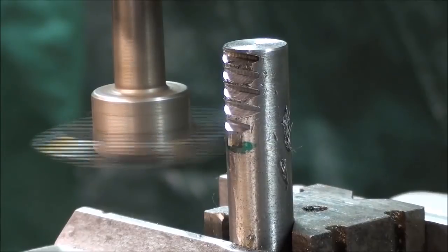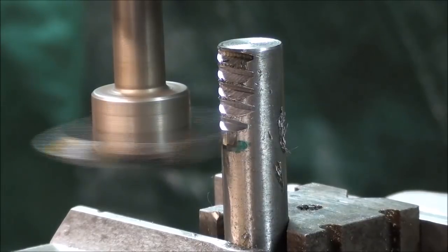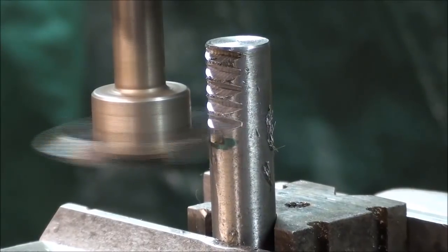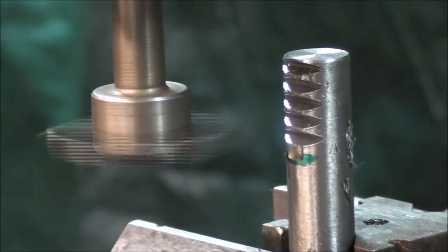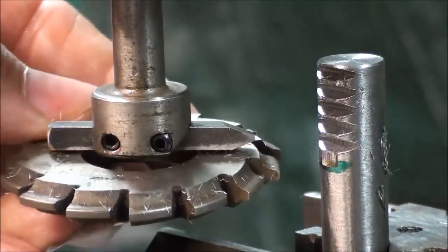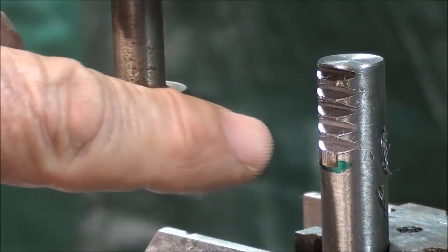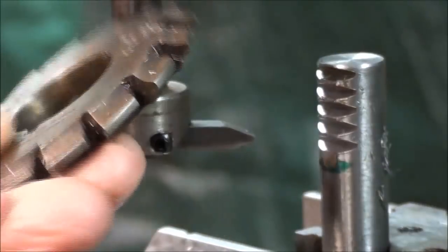This is Tooth 5. How far did I hang the cutter out of the fly cutter? Such that the cutter was approximately the diameter of this, or a little bit smaller. When you're using a fly cutter, of course all of the cutting is done on one tooth rather than on a dozen or more teeth like we have here. So this would be much easier cutting.